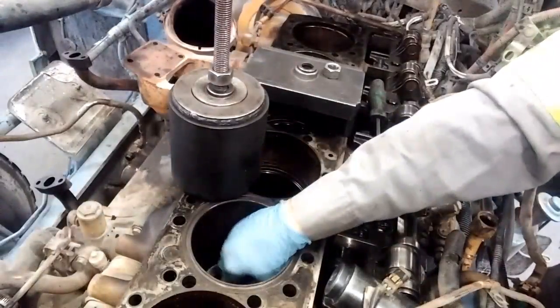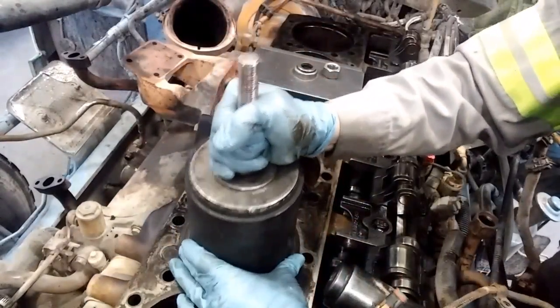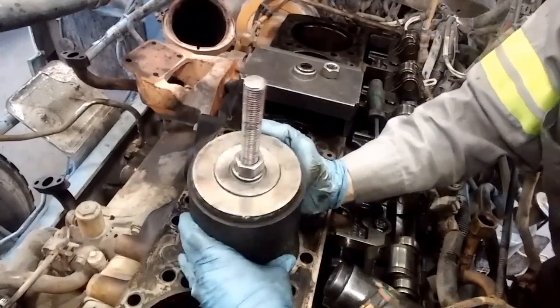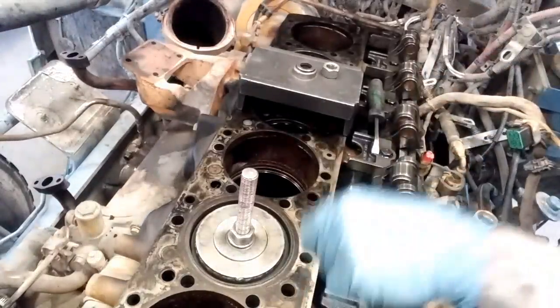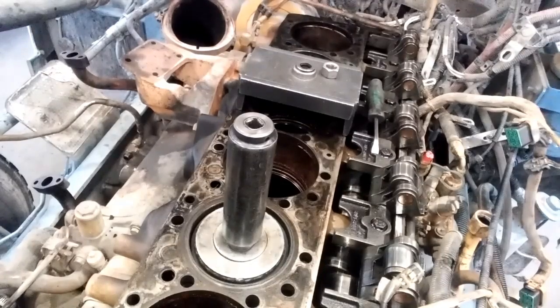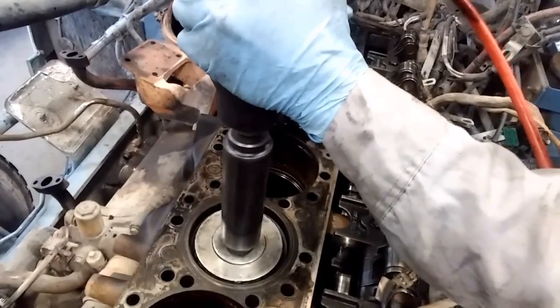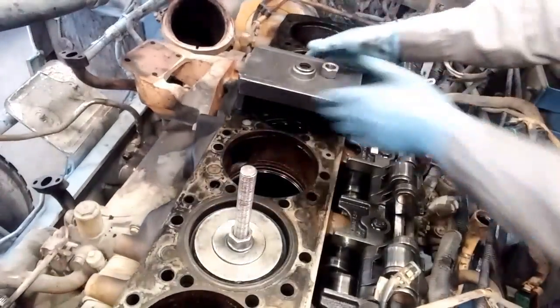We're going to be using this pack puller here. You loosen the pack puller — it has this tapered shaft — and it's a very, very tight fit. It can take a couple of minutes to get it to seat in the cylinders. You push it in and it'll push all the air out of the cylinder, and then that large nut on the bottom you're going to tighten. We have this specialty socket — it's an inch and an eighth and it's really long, about eight inches. It's a half-inch drive; I usually use an impact. You don't need it super tight — I usually put it on the lowest setting of my half-inch gun, which is about a hundred foot-pounds. It is now tight and you can't pull it back out.